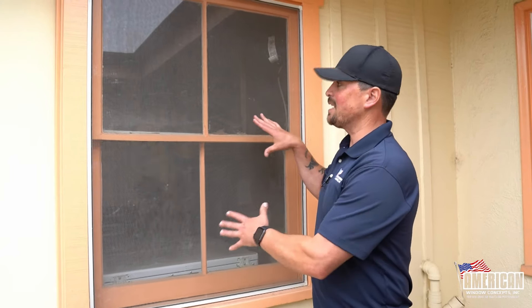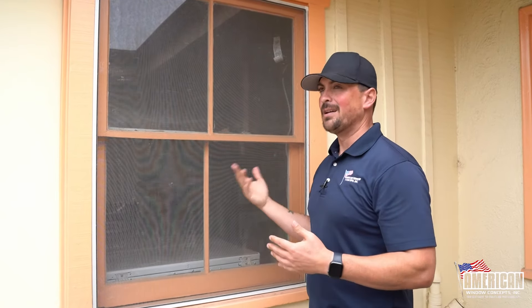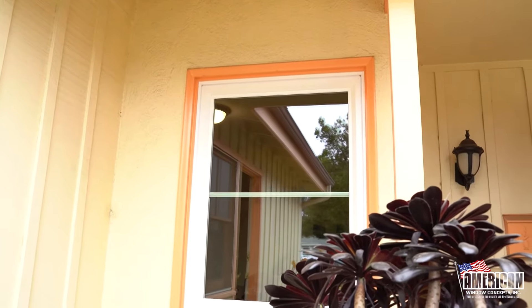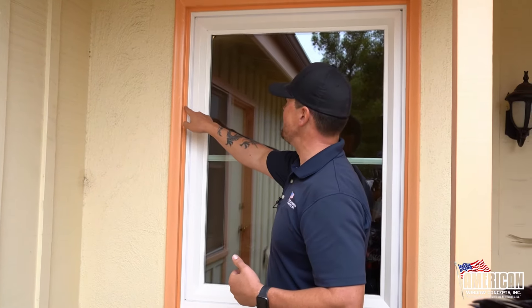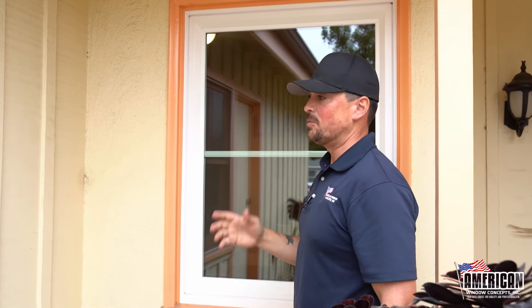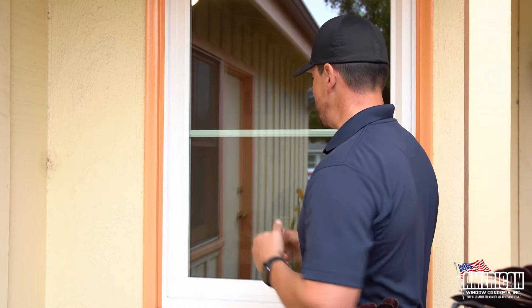This is the size window that was in that bedroom. If you have a double-hung and you try to replace it with another double-hung style window, with today's codes you're not going to meet egress requirements. So we go with a casement window like you see here — this gives you the ability to open it all the way up and easily meet egress codes. We've left the main frame, the exterior stop is completely painted over, caulked all the way around, and this thing is absolutely watertight. It's a wonderful window to replace a double-hung or single-hung in a bedroom.